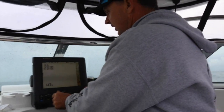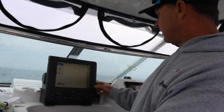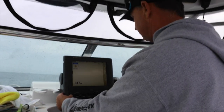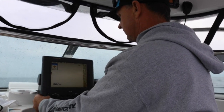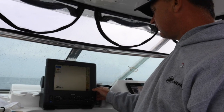Then we go to range and dial it down to 80. Now you can see instantly — press enter on that. We're not getting the bottom, so we press the shift down and you can see it rising up through the screen. Go to 270 and you can see the bottom — there you go, 270 — you can just start to see the bottom there.